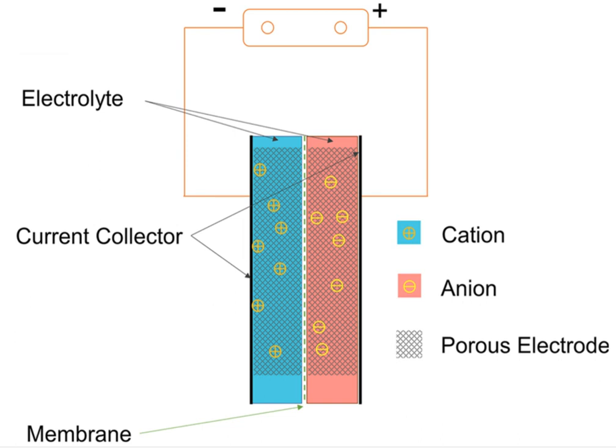Asymmetric electrodes: pseudo, EDLC. Recently some asymmetric hybrid supercapacitors were developed in which the positive electrode was based on a real pseudocapacitive metal oxide electrode, not a composite electrode, and the negative electrode on an EDLC activated carbon electrode. An advantage of this type of supercapacitor is their higher voltage and correspondingly their higher specific energy, up to 10 to 20 Wh per kilogram, 36 to 72 kJ per kilogram. As far as known, no commercially offered supercapacitors with such kind of asymmetric electrodes are on the market.